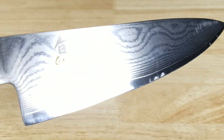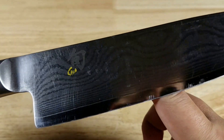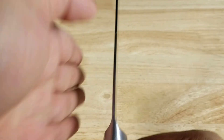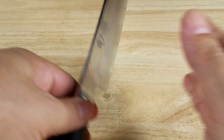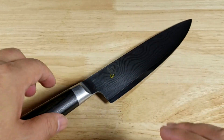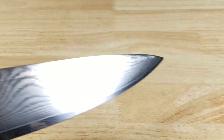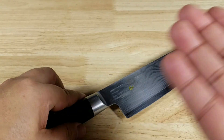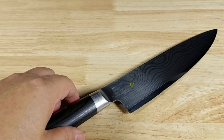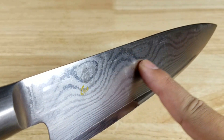Let's have a look at the striking ripple pattern that runs through the entire knife blade. This is pattern-welded Damascus. The way this works is you've got 34 layers on this side and 34 layers on this side. They alternate-stack different types of stainless so that when they're grinding it from the thick to the thin side, that pattern comes out, and then they acid etch it. One of the layers accepts the etch and the other one repels it, so one side is darker than the other — and that's what this beautiful pattern is.